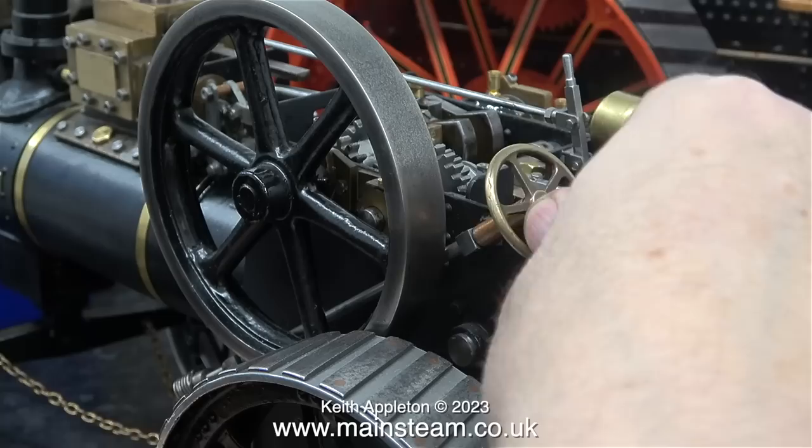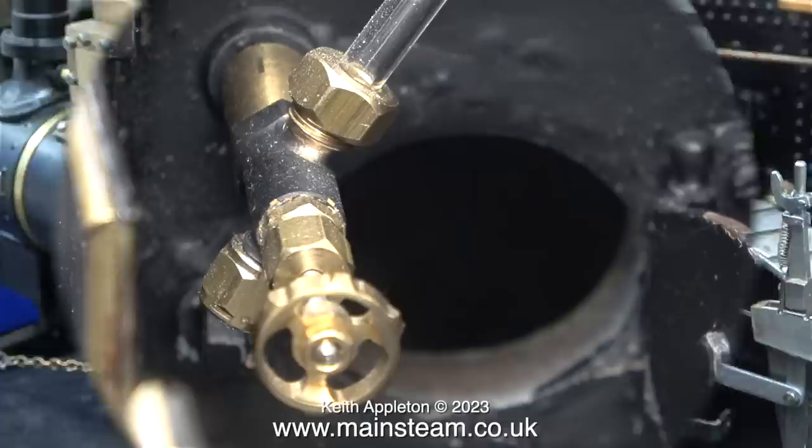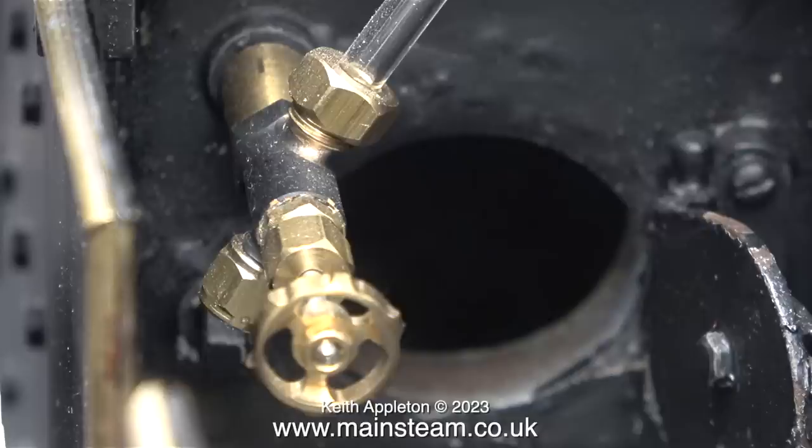When I wind the steering wheel it takes ages before it pulls the chain — it reminded me of a Ford Transit van I used to have with a faulty steering box, but it wasn't as bad as this. Back to the air pressure problem — maybe I can get some air into the boiler via the water gauge. I noticed the water gauge looked a lot newer than the other parts and may have been recently fitted. It's also not fitted very securely into the boiler. As soon as I put a spanner near it, it moved so much that the glass would have fractured had I continued. I also noticed you can't shut the fire hole door because it fouls the water gauge, which really does look recently fitted.